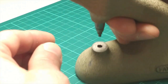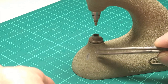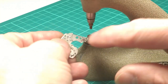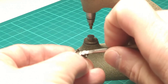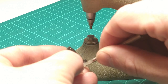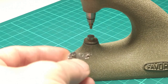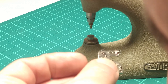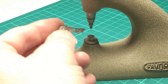Unlike a staking set it's not hollow all the way through, so we need to shake that out. Here is the stainless steel bushing which will be directly replaced with the jewel. Next step — I'm going to take the spade bit and very very gently run that around, just in case there's any rough sections or burrs, so just the gentlest run around to remove any burrs. Give that a blow with the puffer, take a look — that looks good, no rough edges, that's fine. Then the next step is to get the replacement jewel, fit it in place, align it, and press it in gradually until it seats.